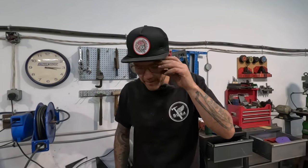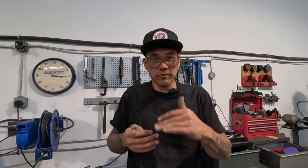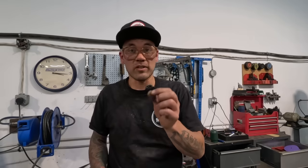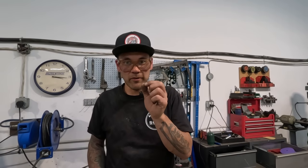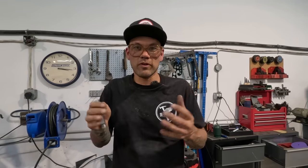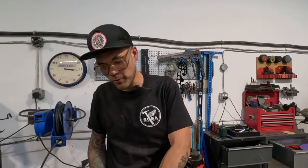One of the things that's happening right now is that in the tight corner where I've said is going to need the most amount of stretch, because we've drilled these holes there and it's weak in that area, yes, it is kind of working. Like, we're getting the stretch we need out of the rounded sections, but right in the centers of that harsh radius, it has actually broken the sheet metal flange on the outside of the weld, which is not a big deal. That hole that's welded, that little tiny piece that I said was gonna probably stretch as we go around, it's a little bit too much for it right in the peak of the corner.